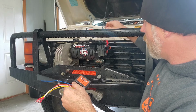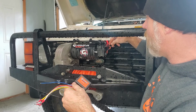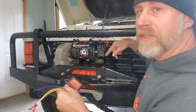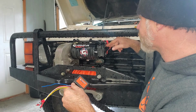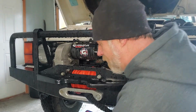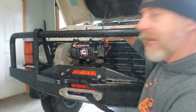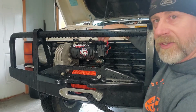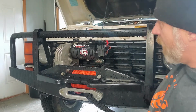Where are you getting the power? Your main power comes into your solenoid from your battery. That's your main power for the solenoid. So your power's in there, it's sitting there, waiting to be switched by power being applied to these spades, in or out. Then once the solenoid receives that power, it does its switching inside, takes your main battery power and pushes it out, whether through cables or the bus bars, to the 3 lugs.